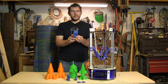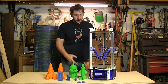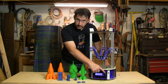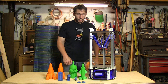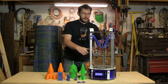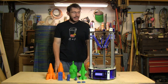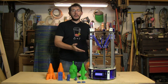The printer itself is fairly easy to operate. It's got a power switch, an internal fan to cool the electronics in the base, an LCD up front, an SD card slot, a selector switch for menu items, a little piezo for clicks, and a reset button that returns it to home position. Right now I'm choosing to print a thin square test piece. The bed will heat to 60°C, the nozzle to 215°C, then the nozzle will home itself, drop to the bed, and begin printing.